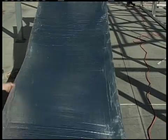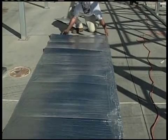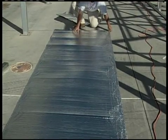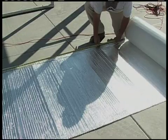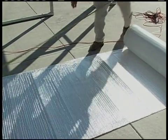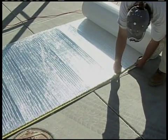Roughly a quarter inch thick, this insulation is designed to be put directly on the frame before you put the exterior panels on. Take a measurement from the bottom of the base rail to the top edge of the first roof purlin and cut a length of insulation to match.